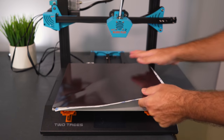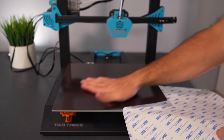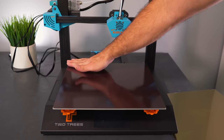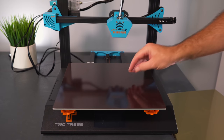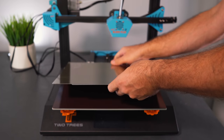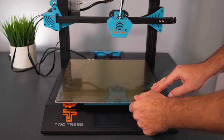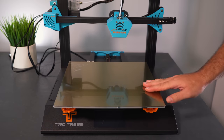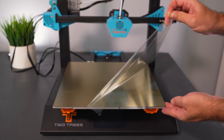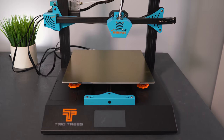After a few tries I got good at this part. We just peel the sticker while massaging the mat into the aluminum plate. Then the top PEI sheet magnetizes right to it — lines up perfectly. There's a little tab up front to peel it off easily. I'll go ahead and peel the plastic protective coating off, and now our bed is finished and looks really nice.